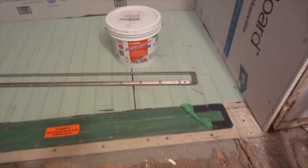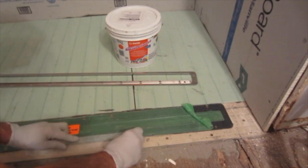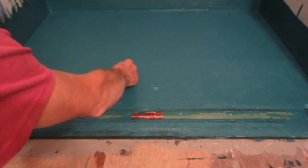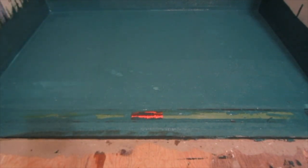Same way with your inside corners. I'm also going to tape out to here to give myself waterproofing that's coming out to my tile. So that's the first coat of waterproofing. You'll put a second coat on and that will be all that you'll need. It's important to make sure you don't have any lumps or bumps in your tape as you go around. If you do, on your second lap you can always throw a little bit more underneath there. If you have a pucker, just cut it and then overlap your tape on top of that cut — works very nicely.